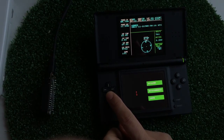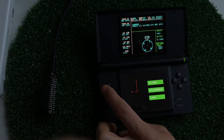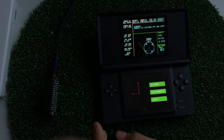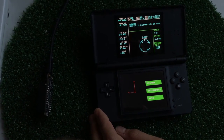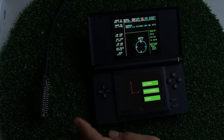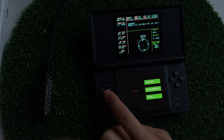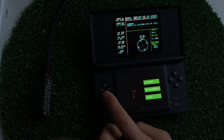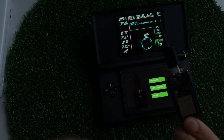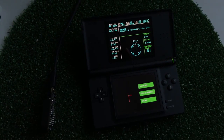In the armed state, we can use the D-pad to control the rover. Let's press the D-pad here. You can see a little arrow is displayed, representing the current vector in X and Y that has been sent to the rover — the input vector that we would like the rover to track — and it responds in function of the D-pad input. Also, every time we press the D-pad, the Nintendo DS sends a 2-byte buffer over UDP to the ESP, which then takes that and sends it via UART to whatever device is connected.